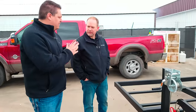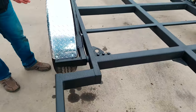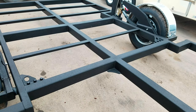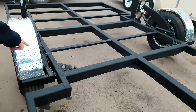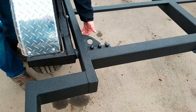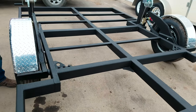One of the questions we get the most: as the engineer, can you explain why the axles don't run all the way through the trailer? If it were a one-piece axle, it would be harder to repair. Also, this tube right here — we've increased its strength, and by tying the axle into it, all the weight is transferred there. Running it all the way across would almost be a waste of material, because this tube is carrying all the weight. We've added dual gussets — one going up tying into the top wall, one going down tying into the bottom wall. We don't tie into the side of the tube because that's the weak part. We tie in where the tubes make their transition from top to side. So we've encapsulated that axle system on four sides, basically.